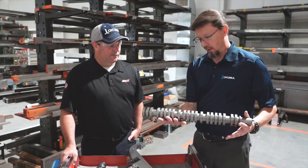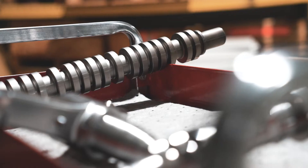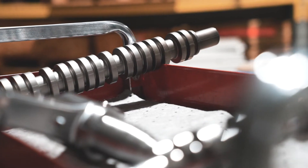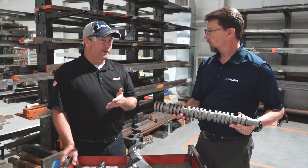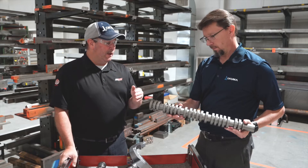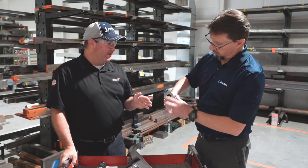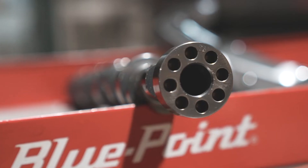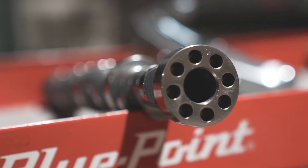Tell me a little bit about the parts that we're looking at today. We're the only NASCAR team that does camshaft manufacturing in-house. Previously we've been doing that on the LU-300MY. We had a tail stock and upper and lower turret and we were basically pinch turning and then pinch grooving. We were having to send our blanks out to have the gun drill portion done — there's a one-inch hole that runs about 18 inches deep into the part — and we were sending that outside to get done.